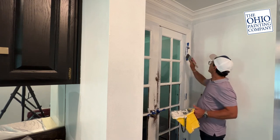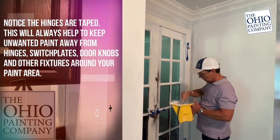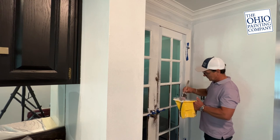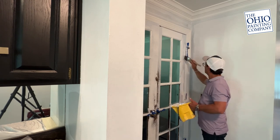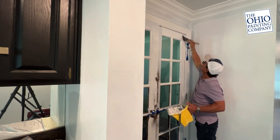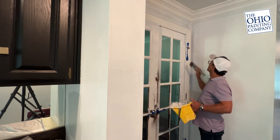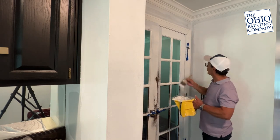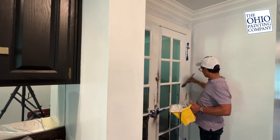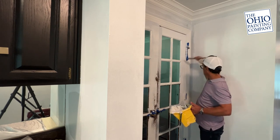The first thing I'm gonna do is come back here and cut in the ends. We've got it all taped up, but we can do that without. Straighten out our little cut there. We're gonna go ahead and bring it down to here and fill it in. We're gonna get a couple of globs of paint, but the main thing is spread it out and find that pattern. Do the same one every time. We'll grab a little more paint — not a whole lot — push that up there, and then go back up straight. Flat brush, no pressure, just let it lay on there and straighten that out, and that should work out really well as it levels out.